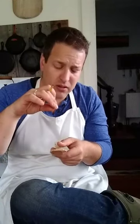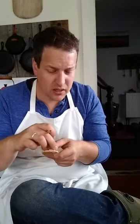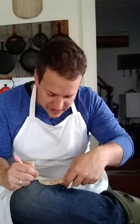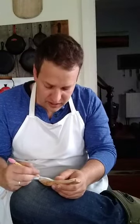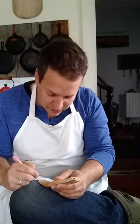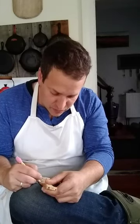You have sheets of grain flowing and wrapping around the spoon bowl with that orientation, and you get the beautiful concentric circles in the bowl. But because they're offset, you don't struggle in the same way with cutting across growth rings. But that usually requires either wasting wood or taking wood from a very large log. So if you're carving smaller diameter stuff, you're going to be doing mostly radial or tangential. I don't even know what the in-between is called.